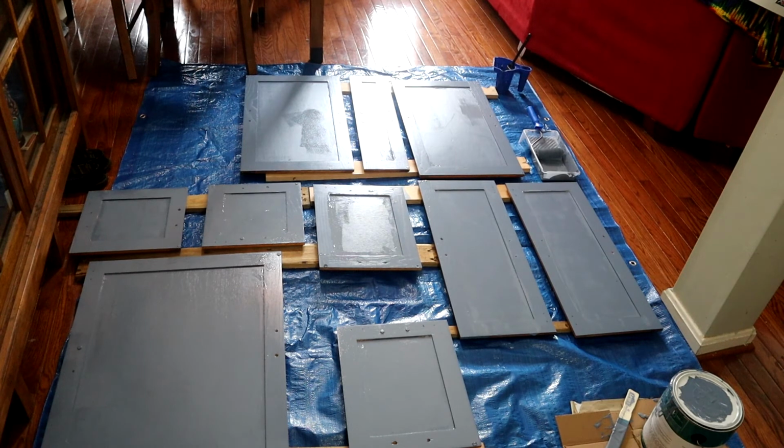All right, so I finished my first round of the insides. I can tell you a tip now that saved me time in the long run. I went ahead and just used a brush. I didn't have time to go get a foam applicator. I used a brush and I just went ahead and did the inside corners first. That way, I don't have to worry about dripping paint. And then once you use your roller in the middle, everything will just roll out pretty fine.